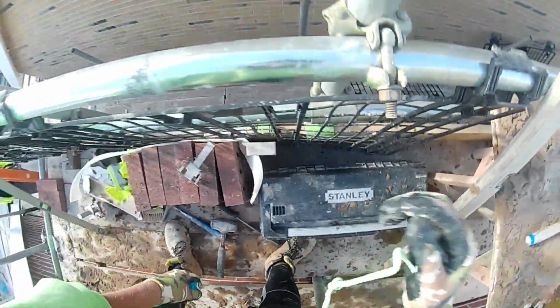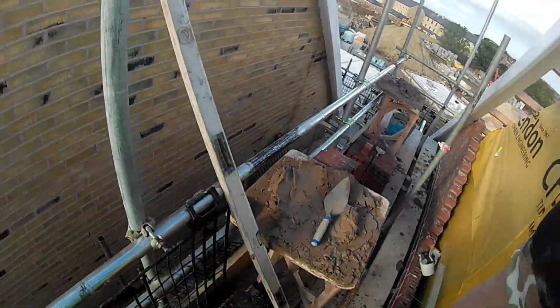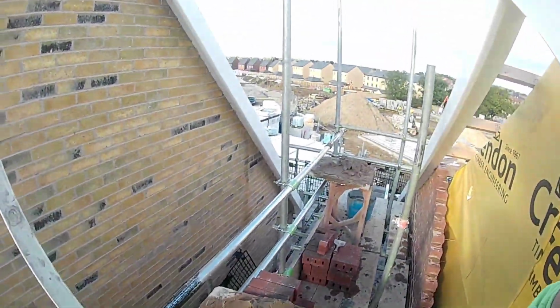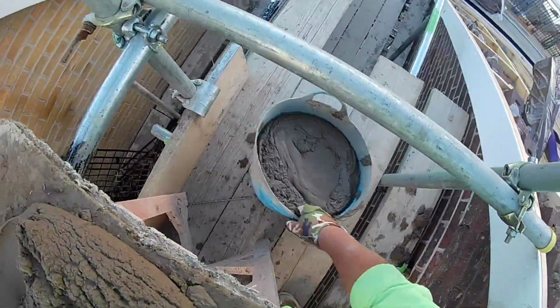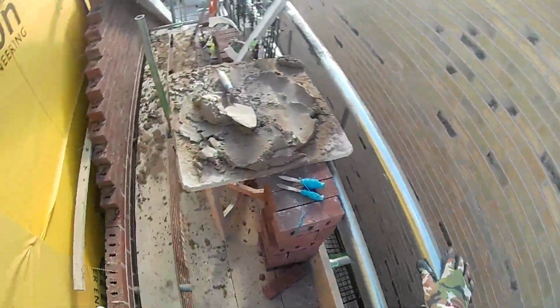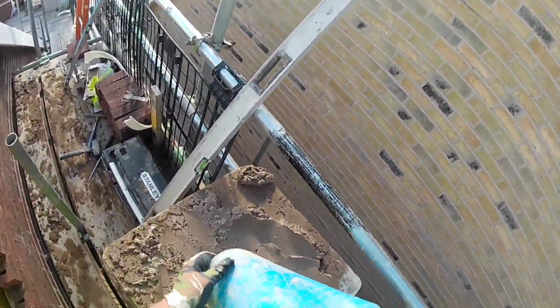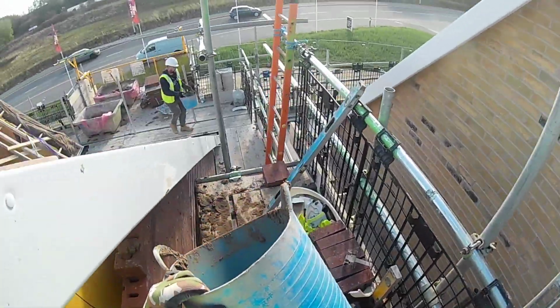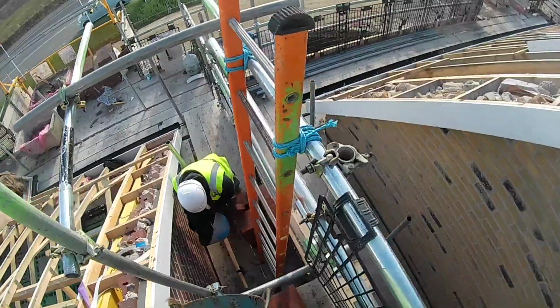And then I'm going to take the other gable up with the block work. My plan is just to do everything by the jack wall last. I might do the back and front, back it with brickwork, then put some on the jack wall, and then fill in the front reveals, because they are a traditional built reveal, like a 200 or a 205 piece, returning to the reveal.